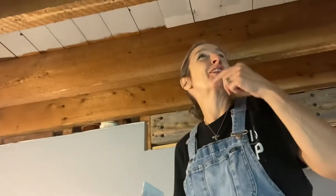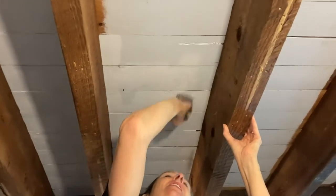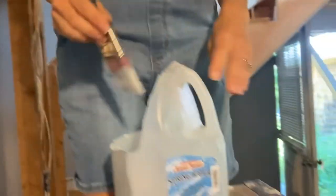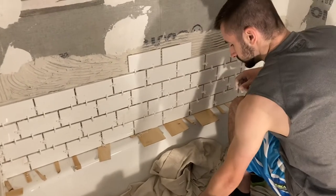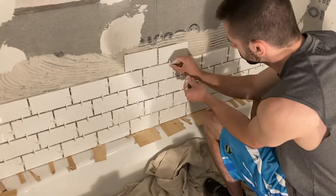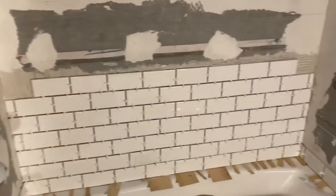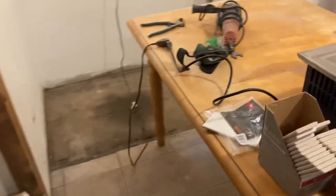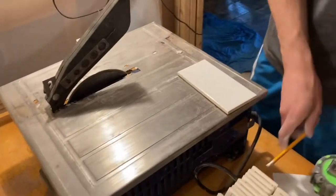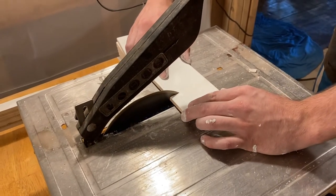Tracy's getting some of the painting done between the beams. We decided to paint the floor underneath — Shane noticed there was staining, and the paint cleaned it up so much better. You can see he's using spacers between the tile. We went with a 3/16ths spacer, which is a little wide, but you're supposed to go 3 times the deviation in the tile — so if you have a 1/16th deviation, you want to go 3 times more than that.